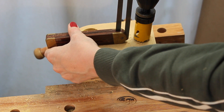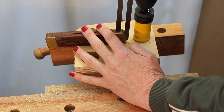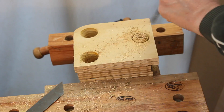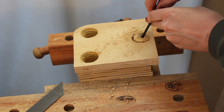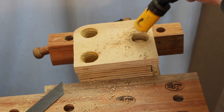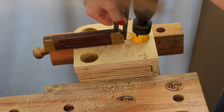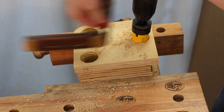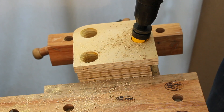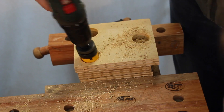One more — this should be a lot easier now as I've learnt some lessons. We go part of the way in and then we try to break the plywood off, and then we can go into our full depth. Brilliant, that's the way to do it — it's so much easier. I think that's the same depth as the others now.